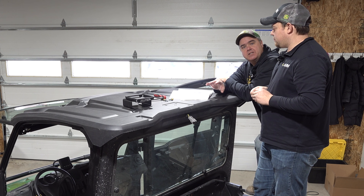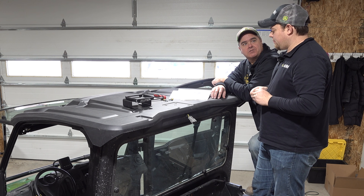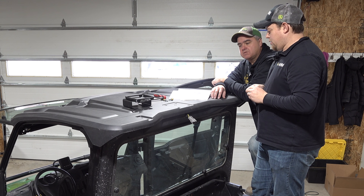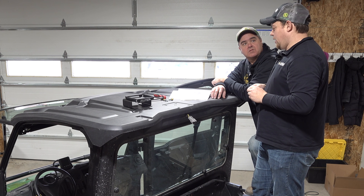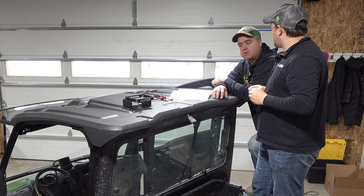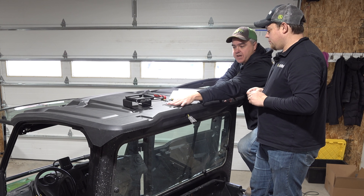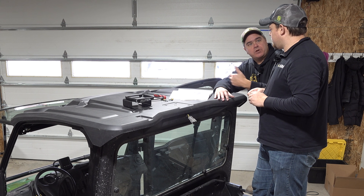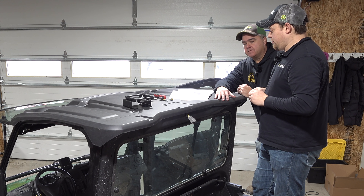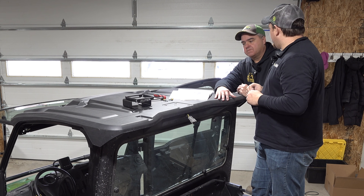It's a little surprising to me that you can get this Green Star equipment to work gracefully on non-Deere equipment. But it works pretty easily — very easy. The biggest thing is CanBus, which is the communication lifeline, and that enables everything to talk as far as a green-to-green solution in this case. So really what we're getting here by putting it on a Gator instead of a competitive brand is these pre-mounting brackets and some of the pre-wiring so that we didn't have to do as much wiring. Deere has definitely heard the voice of the farmer and put this in place in their R&D.